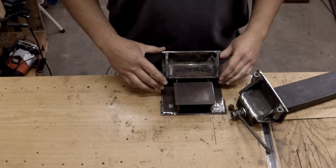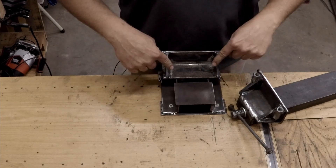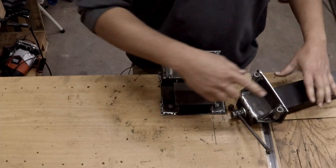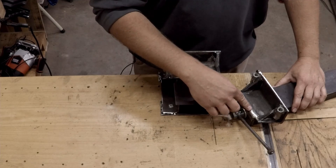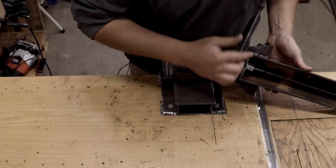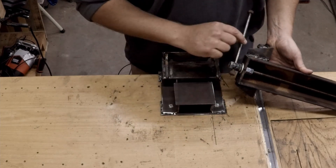I've now welded most things together. I've attached the base to the table with two self-tapping screws just for demonstration. I've welded the two support pieces for the main jaw on the base, and also the support onto the movable part. I've also welded two tube nuts in place — that's for a later project so not too important right now. On the threaded rod inserted at the bottom, I've put three nuts on this end and welded them together.